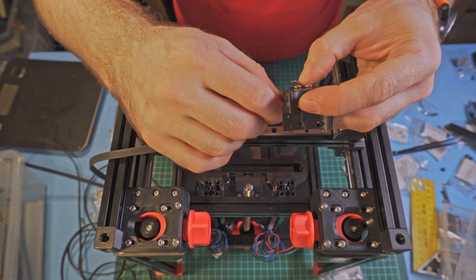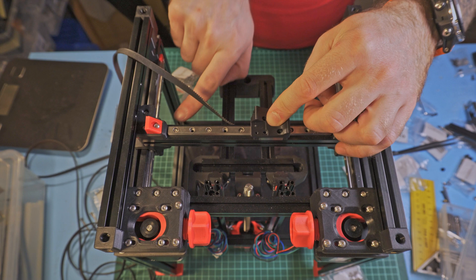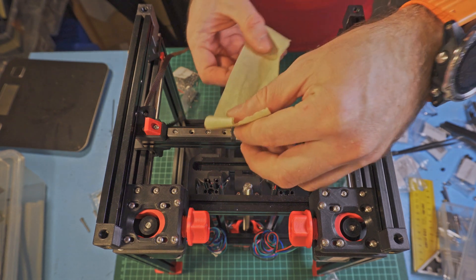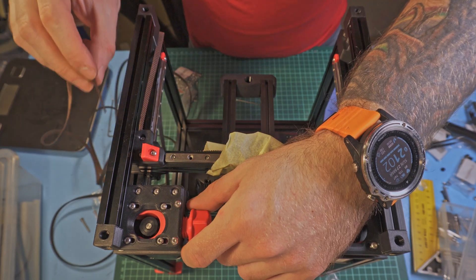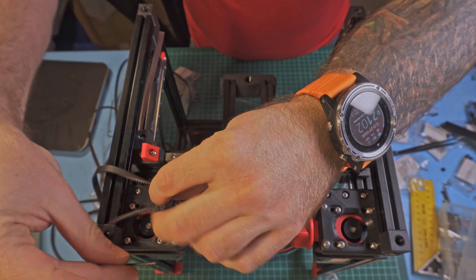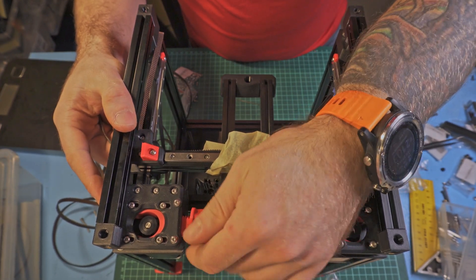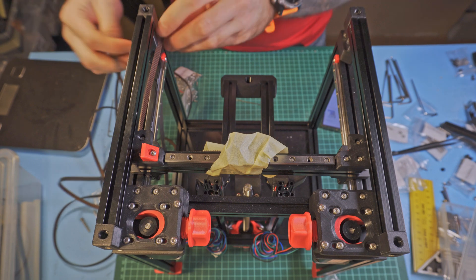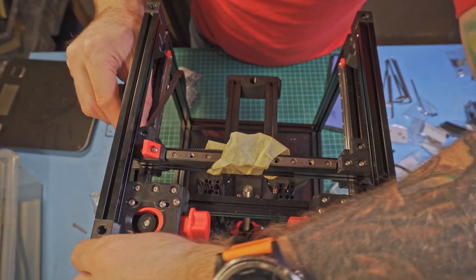I'm not sure whether I should cut the belts now — usually you cut them as late as possible. This is the lower belt, so we'll route it through the pulley. Painter's tape is a perfect way of securing things. I'm going to cover the front idler, push the belt in, route it through around the motor pulley, and get it out through the bearing stack. The nut is completely free and the motor is pushed all the way towards the extrusion, which allows for some tightening later.